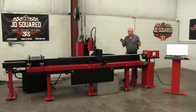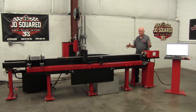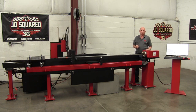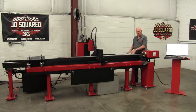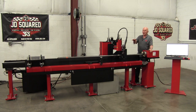What we learned is this: our first four machines were single-structure machines, and that turned out to be troublesome — a lot of it had to do with the material being cut, specifically the weight, moment of inertia, how hard it was to turn, and so on. So we ended up breaking the machine into three components: the carriage and carriage frame, the tube frame or material frame, and the power head.